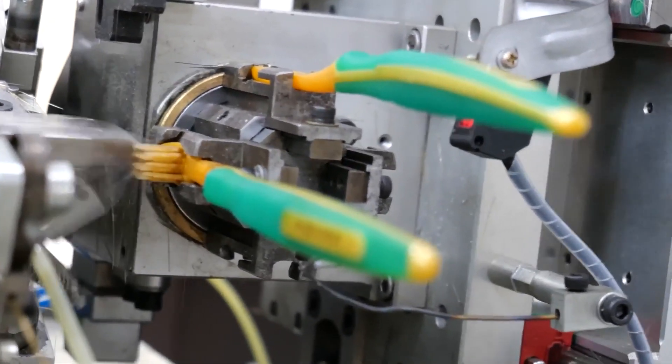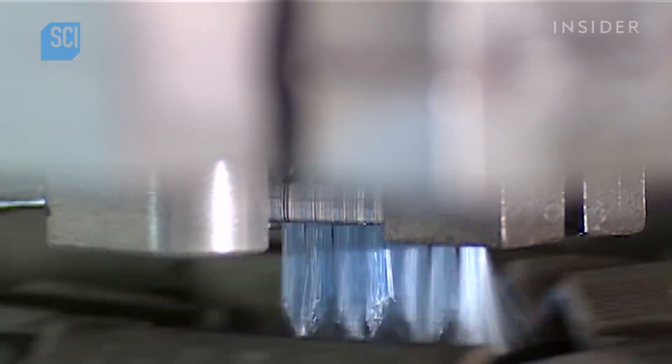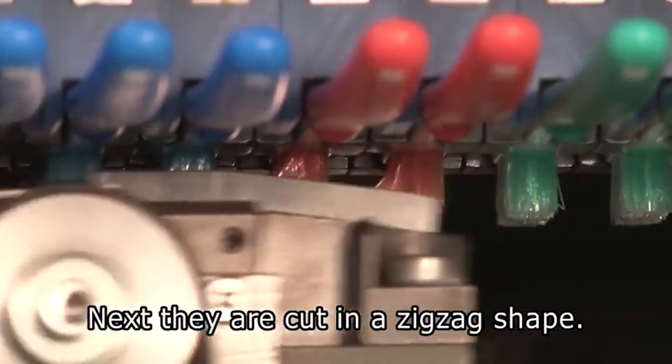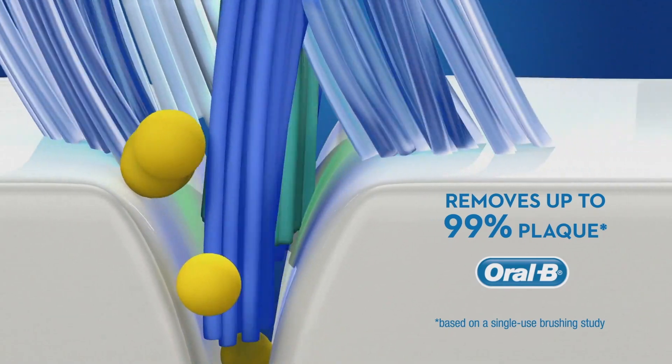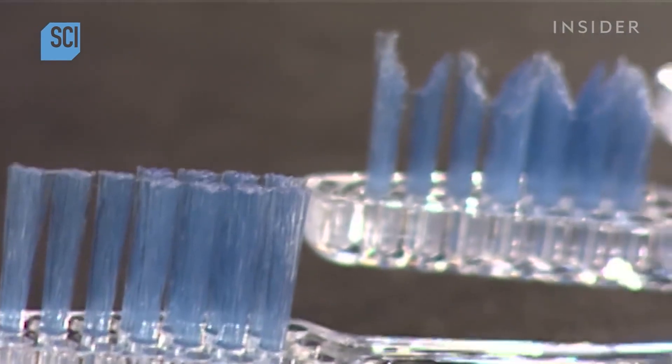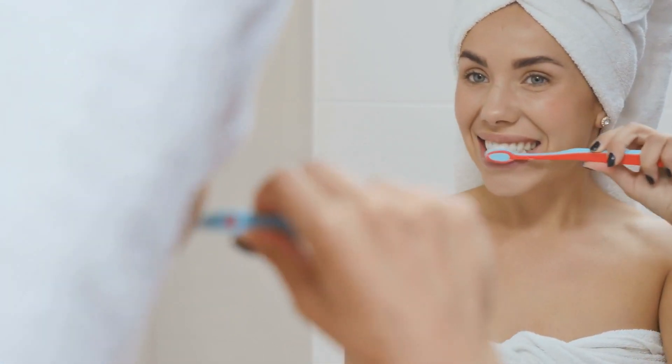Polishing the Bristles. The bristles are refined using sharp blades to evenly and precisely trim them to about the same length. Another set of blades then sculpts the different edges and bristle styles. For example, the Reach toothbrush by Johnson and Johnson includes bristles in a zigzag design, while Colgate offers angled bristles such as the Rippled Bristles model designed to reach plaque trapped between teeth. Gillette has also featured taller, contoured bristles in their Oral-B plaque remover that massage the gums. Rotating discs coated with diamond dust act as a mild abrasive to sand the edges of the bristles, providing a very refined finish.